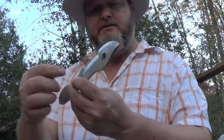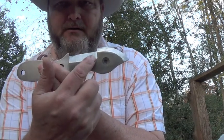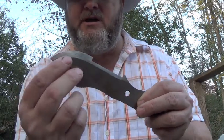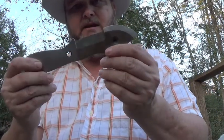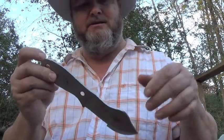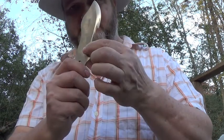From there I went to the last one, and I'm still playing around with it. This one has three different grinds on it. This side has a very high saber grind. Right here has a chisel-type or saber grind. But on the back side it has a shallow saber grind, which almost makes this a Scandi that's offset. The idea behind this was to have a little fire tool — it has the bow drill socket here. It's just a skeleton knife, and you could use this semi-chisel grind, which is not quite a chisel because it has a back grind, to do feather sticks. That's the idea behind it.